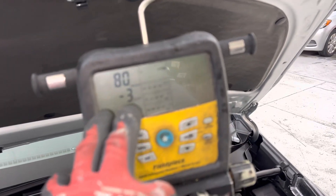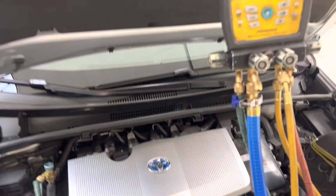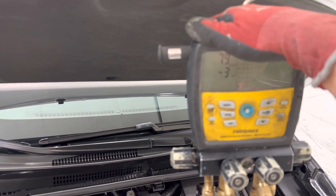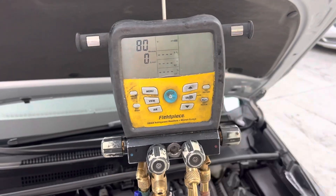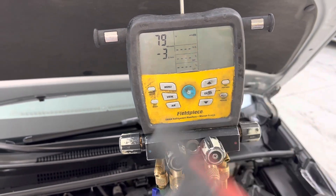Right now I hooked up and I'm checking my gauges before attaching. I had it down for a second, then I thought — I want to show everyone on video because I keep getting new subscribers who miss stuff, especially when they purchase digital gauges. Here's something you cannot do on analog gauges: you cannot check the leak rate under vacuum.